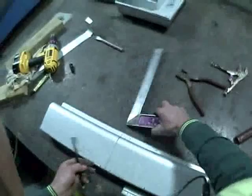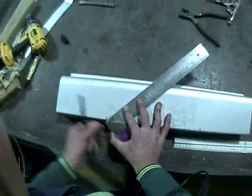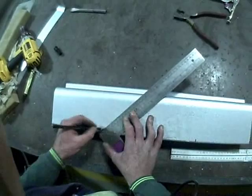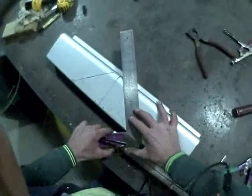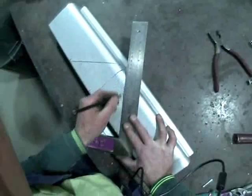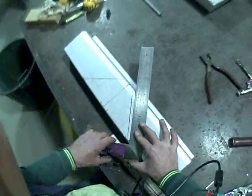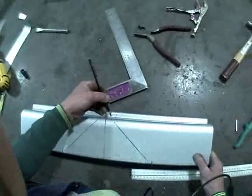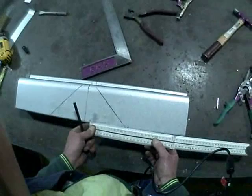Using the set square, we'll line up our lines on the 115mm line and slide over the front, making sure that the line marries up to the edge of the square. Once we've worked that out, we can draw a line across the bottom. I notice I must have been a couple of mil out on that particular point — I'll just recheck that measurement. At this stage these are only a set out, so these lines are purely a guide.